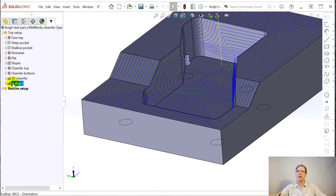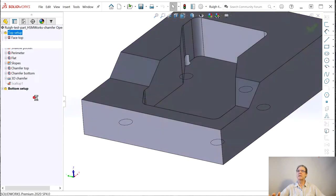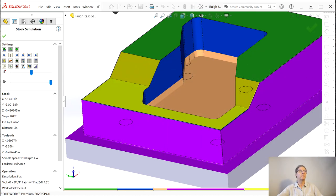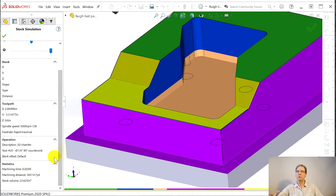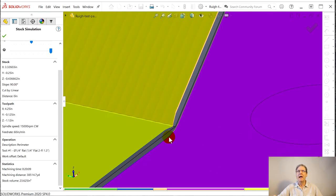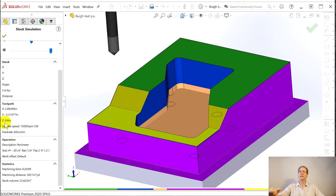I'm rushing here. Scallop — now this is a whole different way to do it, and I can't get it to work unless I model the actual chamfer. We're going to do that, but for now let's suppress this. Meanwhile, we'll go up here and do our stock simulation — simulate it to the end. This pops up. I had it dragged off screen on earlier episodes — this is stock removal. Down here at the bottom it'll say machining time: top setup, width is chamfer, 20 minutes and 9 seconds. And you can see it's doing its thing. The widths are about right because we pulled back on this sloped one, doing the 2D trace. But here's where it falls apart a little — if you get this bottom chamfer a little closer, it'll start gouging. So there's some playing around, still learning. But it's capable enough.